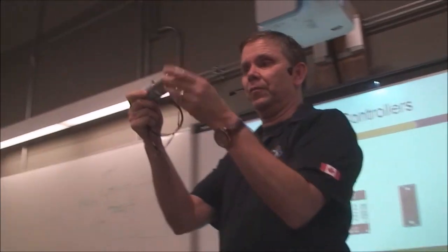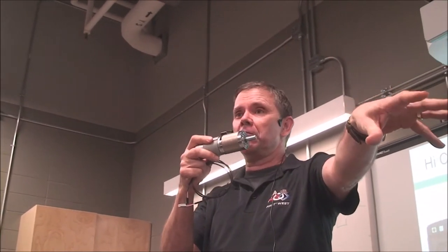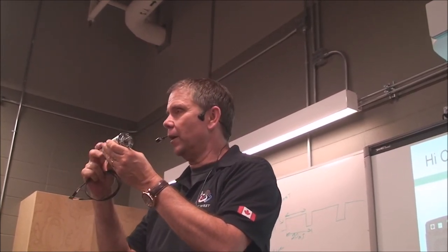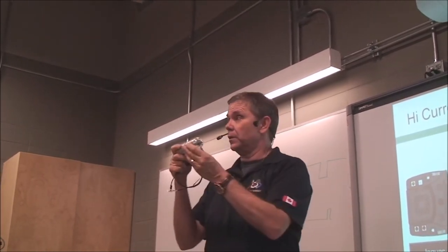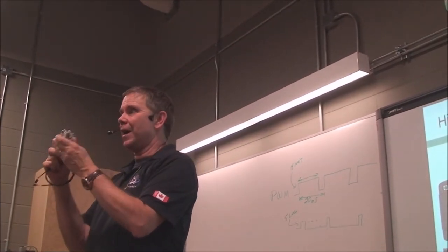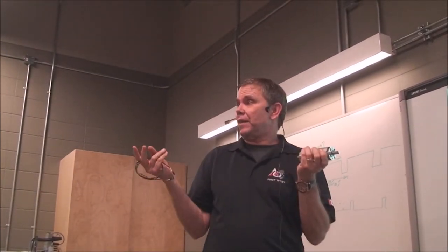This is a sample of one of the gearhead motors. You always get a few CIMs, usually four of these big CIM motors, which are generally used for drives. There are also small windshield wiper motors. There are devices that can either turn the motor on or off only, kind of a Boolean and binary operation. And there are other drivers like these that can actually control the speed of the motors and direction. These can control the motors not only forward at any speed, but reverse at any speed too. So they're bi-directional, high current, high efficiency motor controllers.